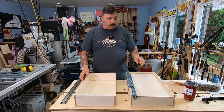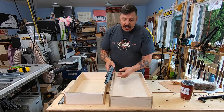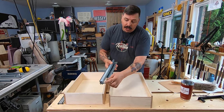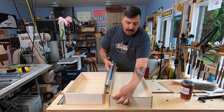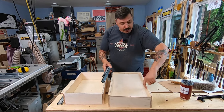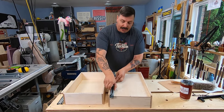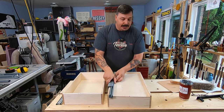When it comes to the under mount ones it's a little bit different, because the drawer actually rides on here and we're going to have a small hole that we would drill down in here. So you have to have about a half an inch or 12 millimeters of space to allow for that to sit in there properly and then it'll work as expected.